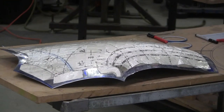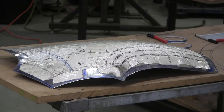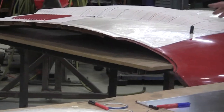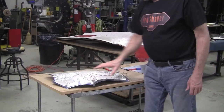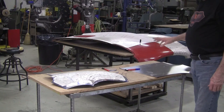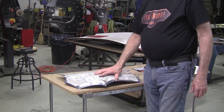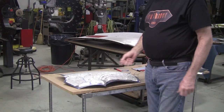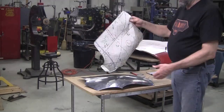The corresponding underneath piece will have two sections similar, and they'll be difficult too. The rest of it — the difficulty level is nowhere near as difficult as this. What makes it difficult is this radius in the front. Now we're going to try setting that radius just by using what I call fulcrum blocks, manually pushing it over and checking it with gauges.